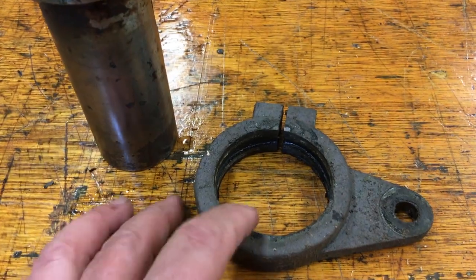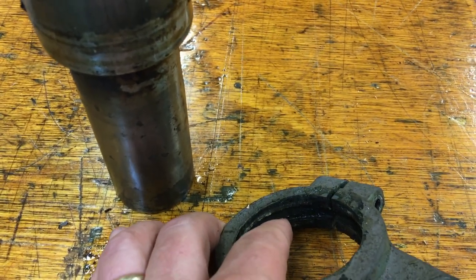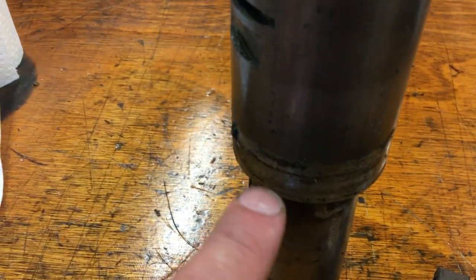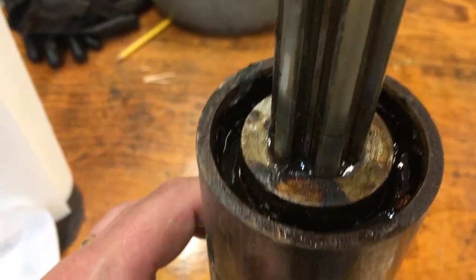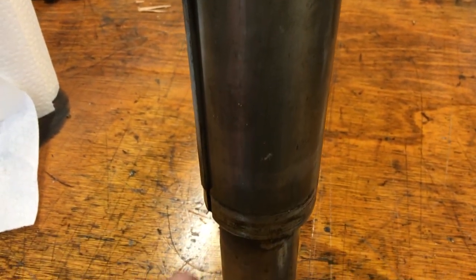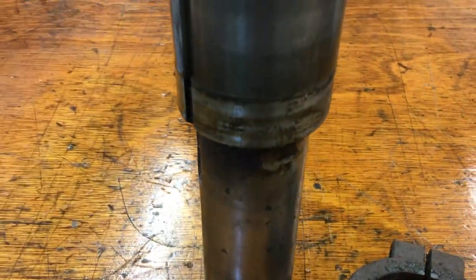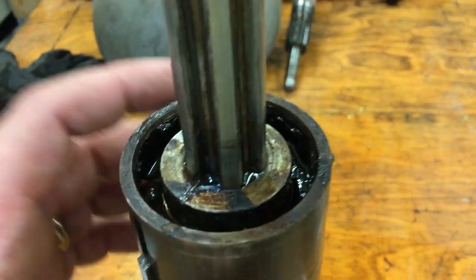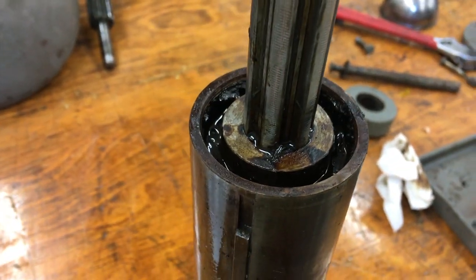So the spindle is out. I took this off the bottom — I'm not sure exactly why it has the inner part recessed like that; it really has two points of contact on the spindle. The spindle turns wonderfully. I think all I need to do is clean that up a little bit, carefully remove some of the gunk in there, and clean up the outer part too — it was a little sticky and sometimes didn't want to come back up. I see no reason to replace the bearings; I tried to move it back and forth inside and it just doesn't move, so I think that run out I measured was actually correct.